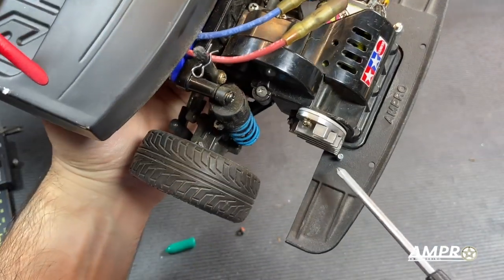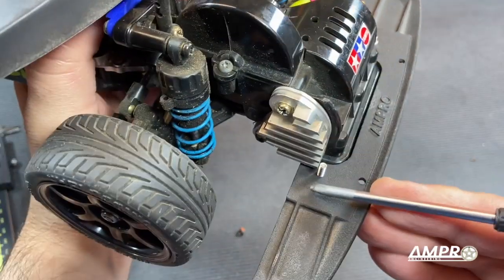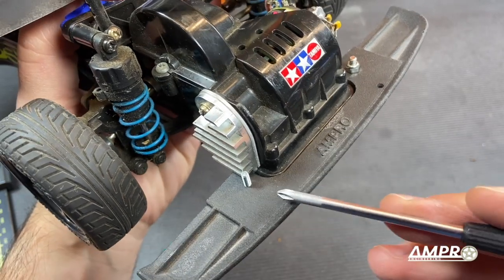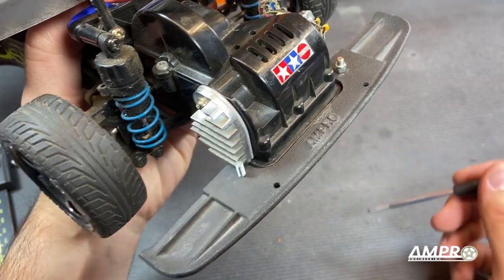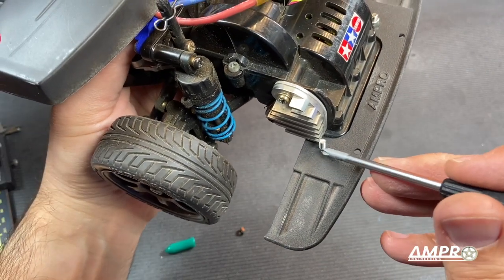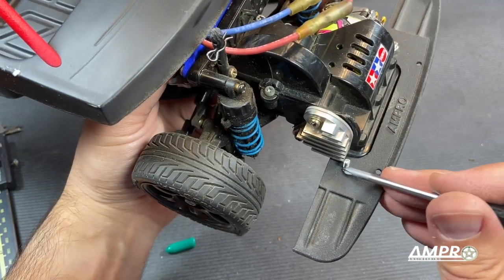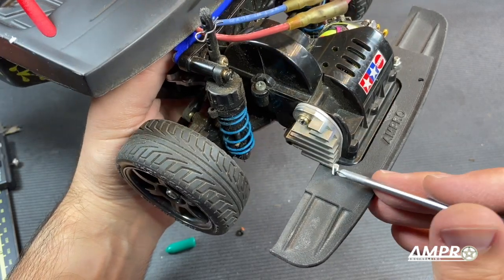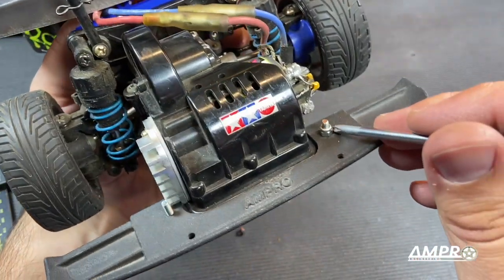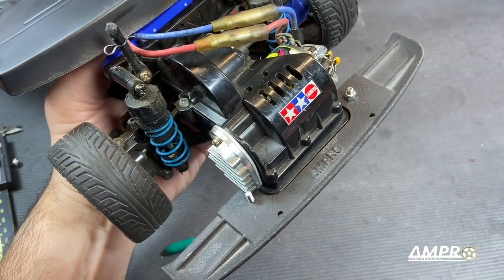One thing to be aware of is that if you are running the motor heatsink, there's very little clearance for this screw to put a nut. So what you're going to want to do is put a standard nut in here. Those are usually around 2mm high. On the production model, I'll have a little recess here in the shape of a nut, but you do not want to use a lock nut unless you're grabbing onto it when you're tightening down from here. Otherwise, the little indent is not going to hold that. So on this side here, you're not going to want to use a lock nut simply because it won't fit because of the fins. Here, I'm going to because I like using lock nuts, which is unfortunate because it doesn't really match, but that's just how it's going to be.